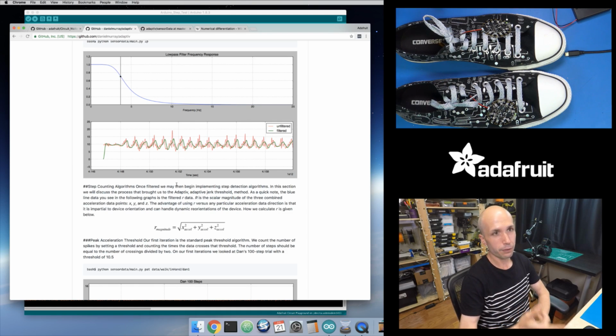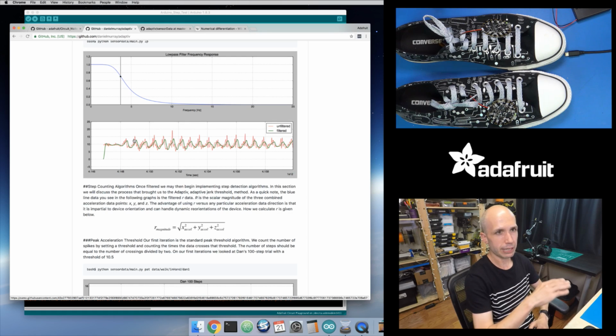And then we saw in the first video, I actually looked at the output in Arduino, we graphed it, and I had a little IPython or Jupyter notebook that I put together that showed how this paper built this filter and what effect it has on the raw acceleration value. So you saw the accelerometer values are kind of shaky, and every little tiny movement is picked up, and you see this real spiky graph, like the red lines back here. But then when you apply this filter, that gets rid of all that high frequency noise, and it just leaves this smoother motion, and that's the green line right here.